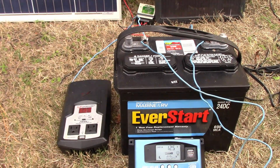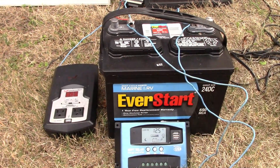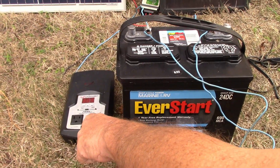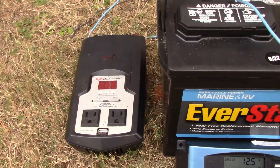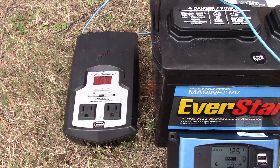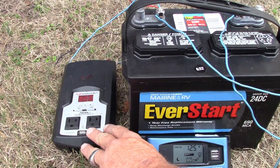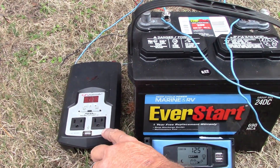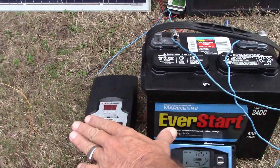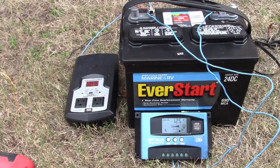I'm going to do a video on inverters to explain the differences, because there are lots of power inverters. For what I need in my house, this is a single-phase inverter — works perfectly for TV and lights. It will not work on my air conditioner because my AC runs on 240 volts and this only puts out 120 volts at 750 watts. I need what's called a split-phase inverter — a split phase will put out 240 volts, so it'll run my AC. A pure sine wave puts out cleaner power with less fluctuations and is less damaging to motors, while the modified sine wave could fluctuate and cause damage. So you don't want to use a modified for refrigerators or motors.